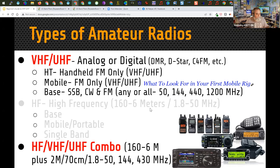Now, what do you do with these bands? First, you need some radios. There's really a choice of FM with analog or digital, and then single sideband and CW modes. There's also a handheld choice, a mobile choice, and a base choice. Some of you may also have an HF radio that includes VHF bands — most HF radios bought in the last 20 years will include 6 meters.